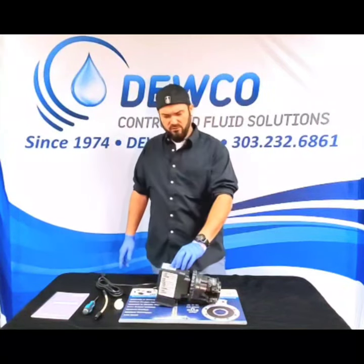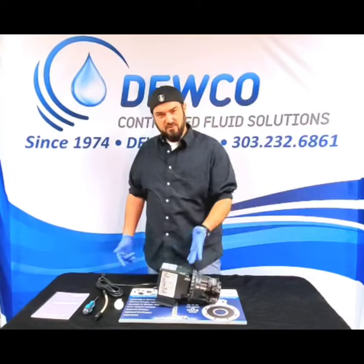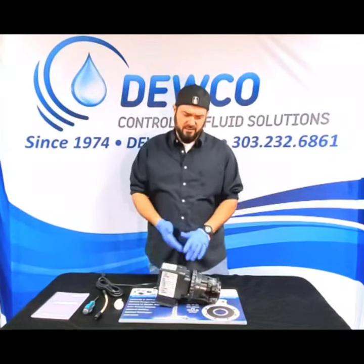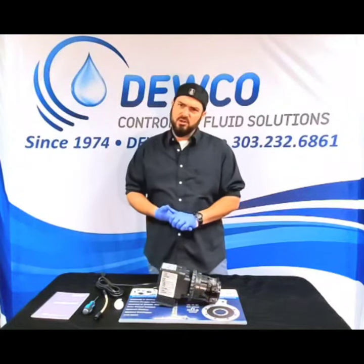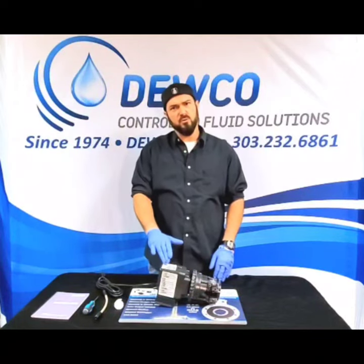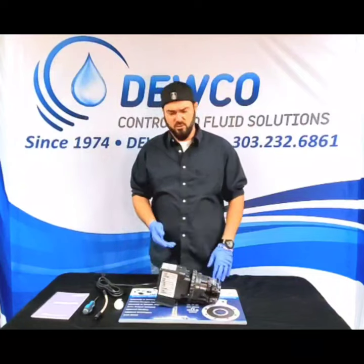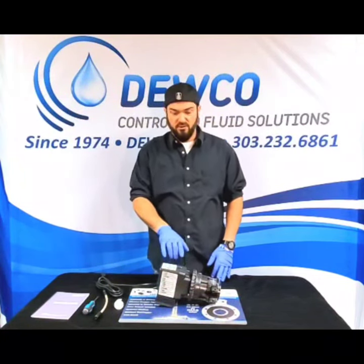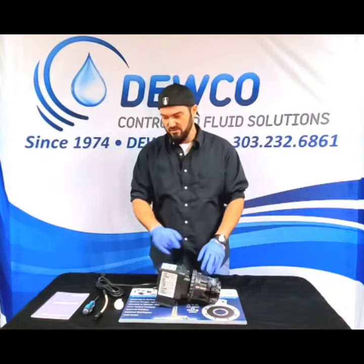Today I'm going to change a 45 MJL-1A1STAA, which is a low pressure, 25 psi pump at 35 gallons per day. This customer is going to want a number one tube because they want to increase the pressure from 25 to 100 psi, but they don't need as much output. So we're going with the number one tube, which gives you three gallons a day rather than the 35 that the number four tube allows.